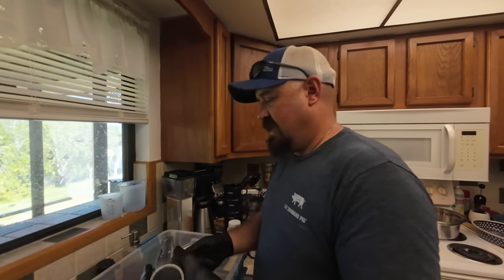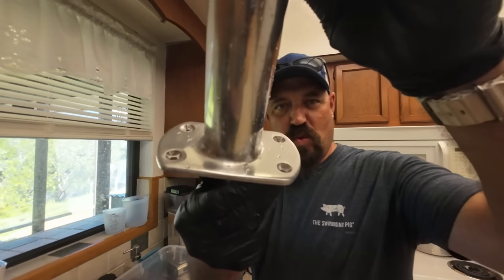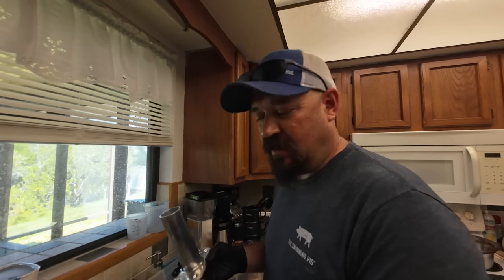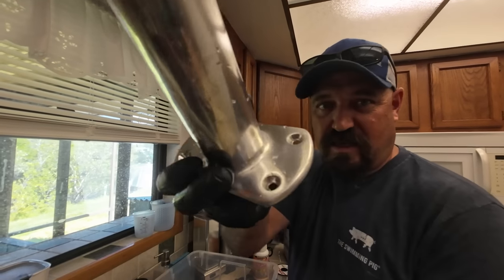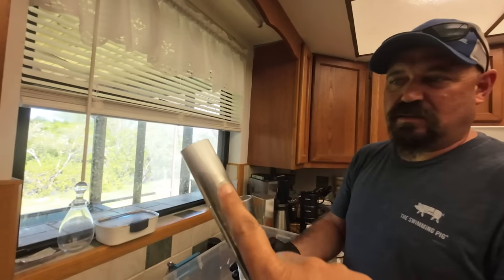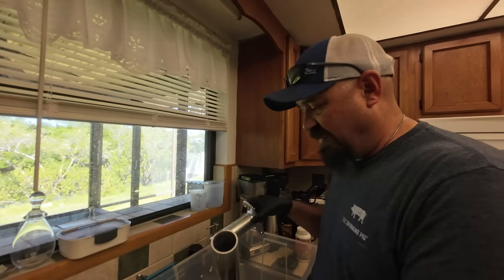I have made this riser piece and this fancy base for Scott and Lori's lightning prevention. It's all polished up, but the sad part is I have to rinse it and degrease it in lye. The lye will get any finish off and remove residue from the polishing compound. The sad part is it goes from this shininess to a kind of satin finish. I want to show you what it looks like before I dip it. I've got the solution and bath mixed up, and I have a couple holes to drill and tap first.